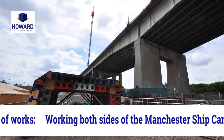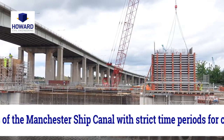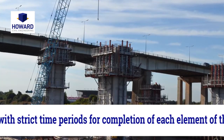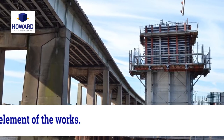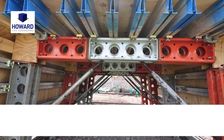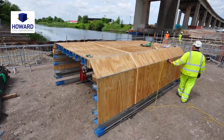The towers are a very complicated shape. The external formwork is a standard shape throughout all the way to the top, so we've used RMD ascent formwork. The ascent formwork enables us to lift the outside shutters all the way to the top of the tower for every pour without bringing them to ground. This is a safe way of working as it eliminates the necessity for working at height, taking shutters off and bringing shutters back on.